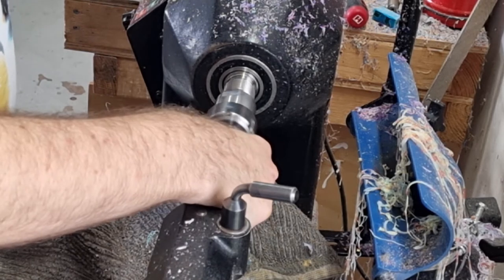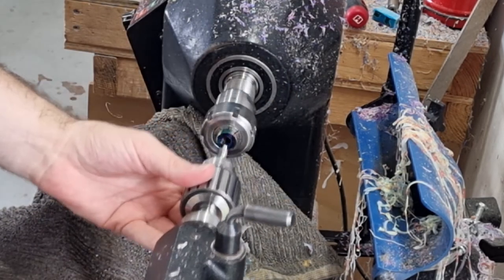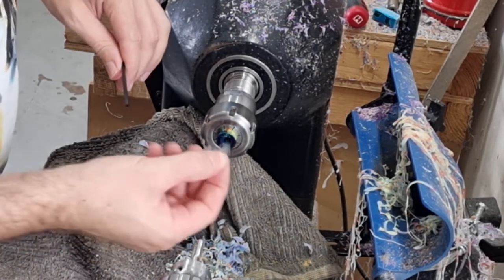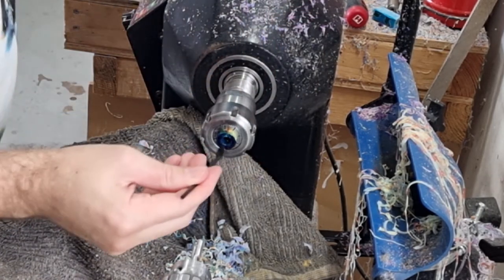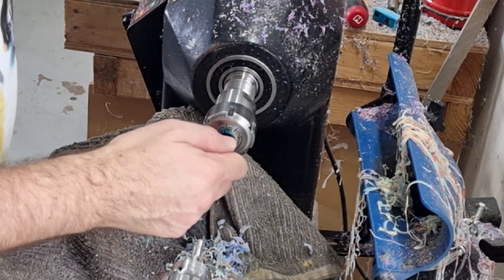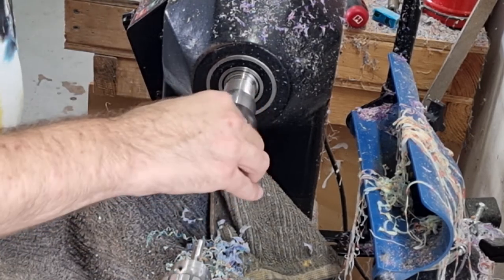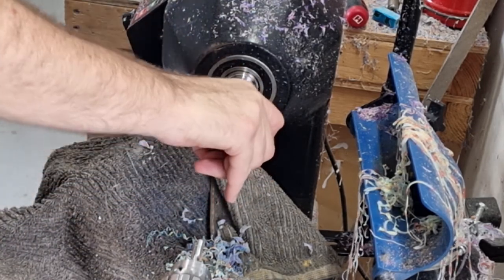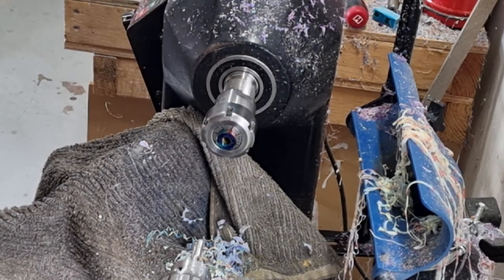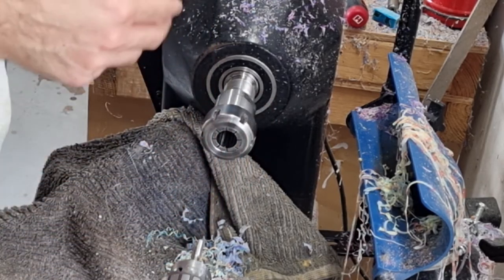You can feel it cutting. You need to go in about 4–7mm or so, then you should be able to pull out with the threads cleanly cut. This is where most people get into trouble — you think you're done, but the nib section will go in only about half a revolution and then stop. The Bock ones are just a bit difficult; I've used a couple of different taps from different manufacturers and they all seem to have the same problem.